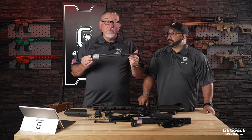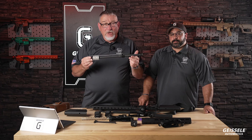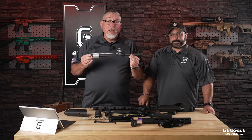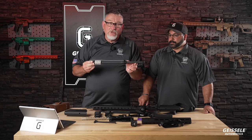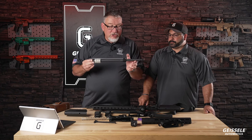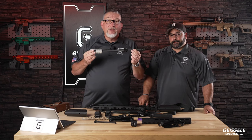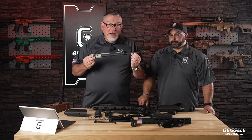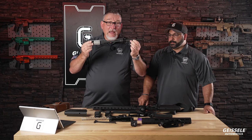Many gun makers don't want to move away from the standard carbine or mid-length or rifle-length gas systems, because it's very easy to call up a supplier of the gas tubes and say, send me please 300 carbine or mid-length gas tubes, and they come to your door, whereas Geissele goes through the engineering in order to optimize the bolt carrier speed for the cartridge, its intended use, and length of the barrel. And through our calculations, we come out with an optimum port size, an optimum place for the gas port. And then we have to engineer our own gas tube, but this optimizes the weapon system. This gas system length provides very soft shooting and perceived recoil reduction in the gun.